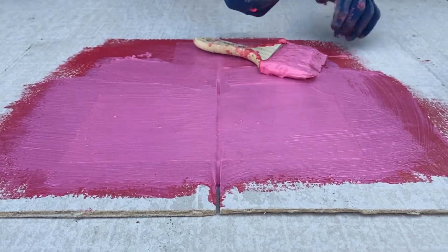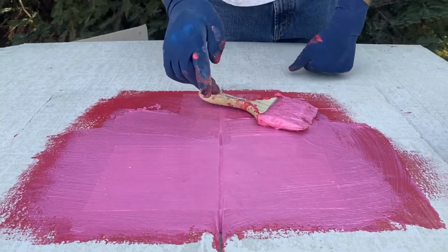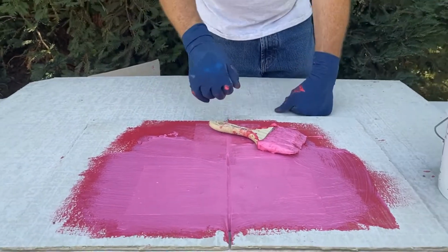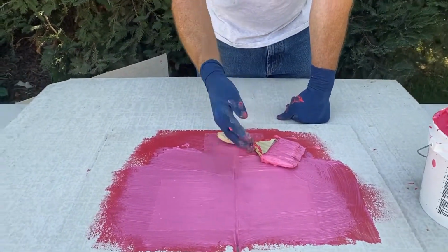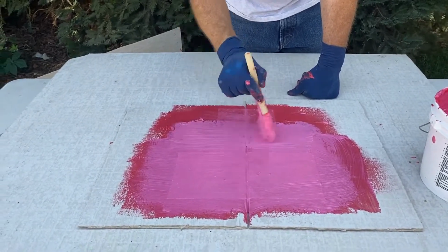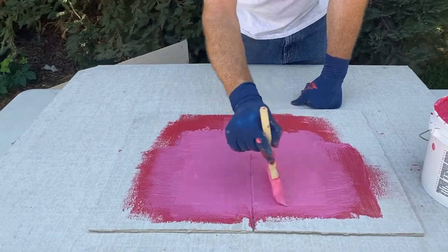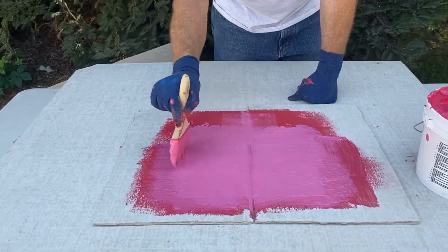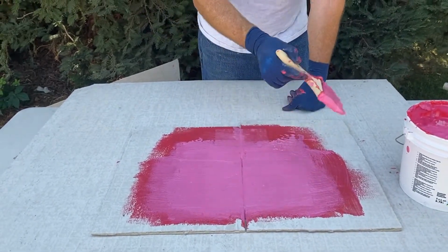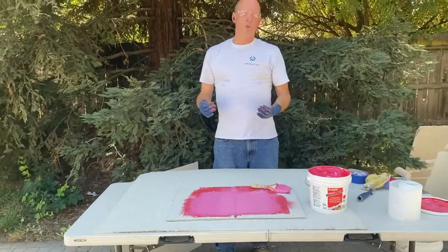Now, if this slab moves apart and that expansion joint opens up more, with the divot in the fabric, that fabric now has room to move and still not break and still keep this waterproof, and also allow for movement of a movement joint. If we've done it like this, we've really restricted that amount of movement. If it compresses, that's fine. If it expands and that joint opens up, it has no room to go but rip that fabric. So that's how we do fabric reinforced waterproofing.